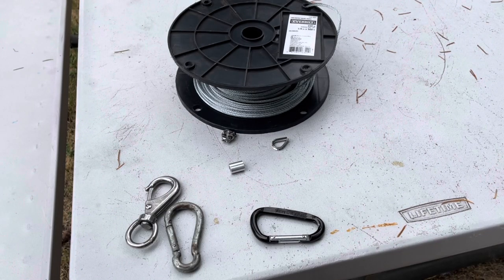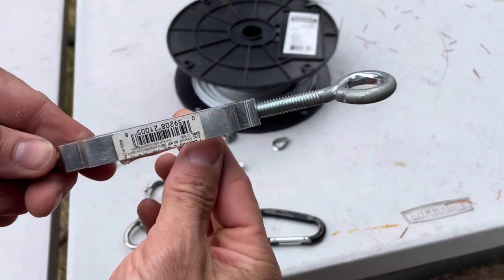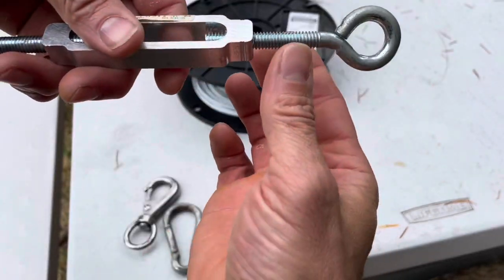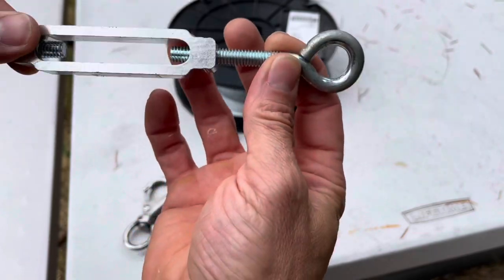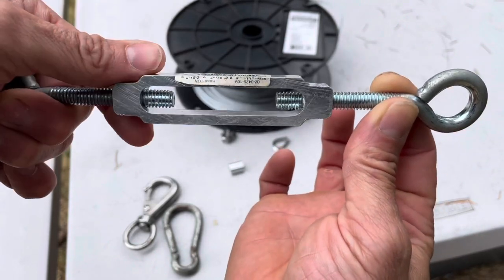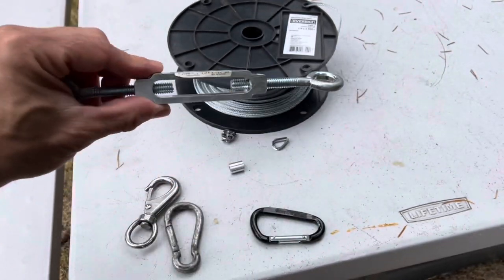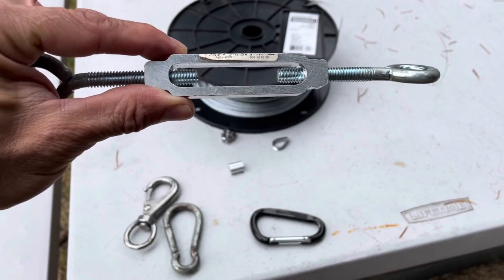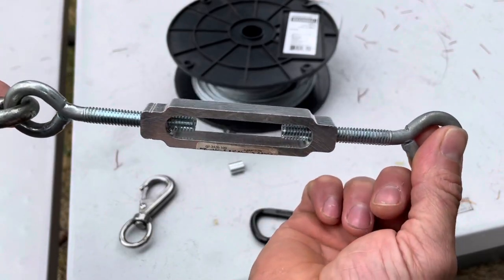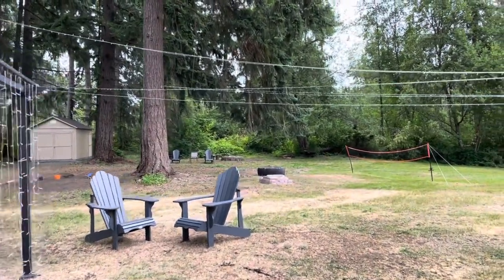If you're hanging your cable and just cannot get the slack out, this tensioner here is a great choice. They come in zinc, aluminum, and stainless steel. You hook a cable to each end, and the centerpiece turns to loosen or tighten without twisting the cables. You can get about three inches of slack out of the line, which is actually a large amount. These are recommended if you're planning something heavier duty than twinkle lights. They go on each mounting location and you can use your carabiners to hook them to the tree, with the tensioner between the tree and your cable.